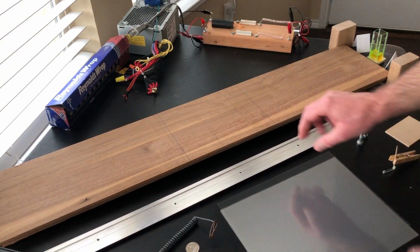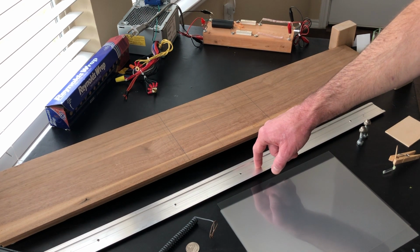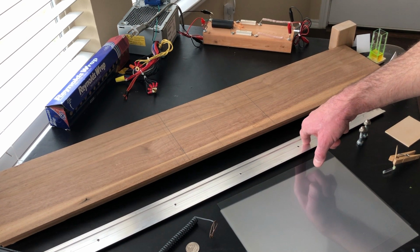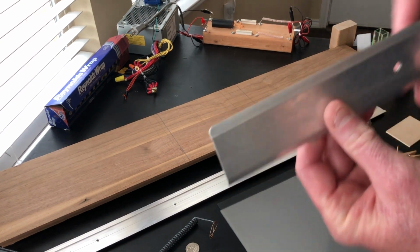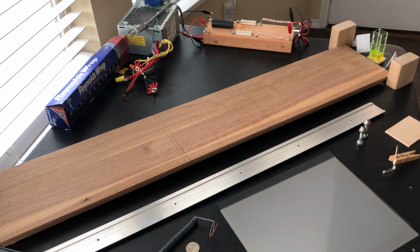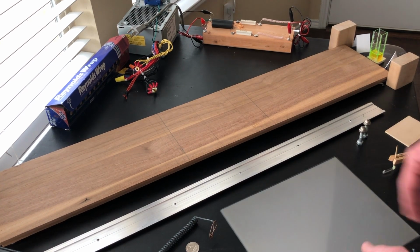The actual electrodes I'm using for this laser are like a yard long. Well, actually, they're 35 inches and 7/8, I believe, when I measured them. These are going to be the electrodes, and they're saddle thresholds that you can get out of a hardware store. And the reason you're using this, again, I'll use this for an example, is because the edges of these are raised. You get your laser discharge to occur above the surface of the dielectric. At least that way, there's a little clearance there. I think it also makes the discharge probably better because it will tend to be less likely to track along the edge or the surface of the dielectric, which is not what you want.